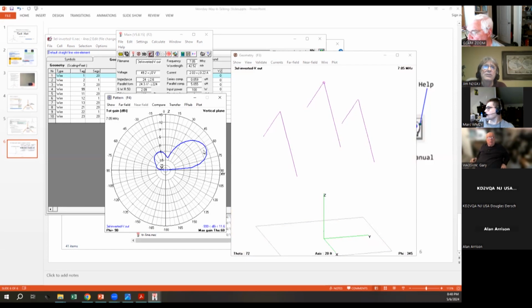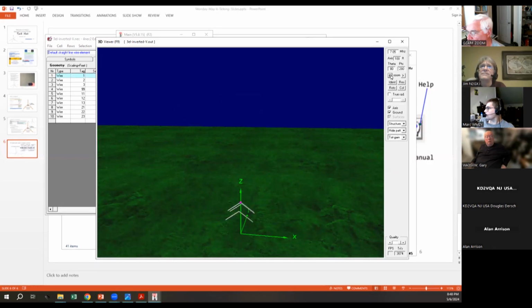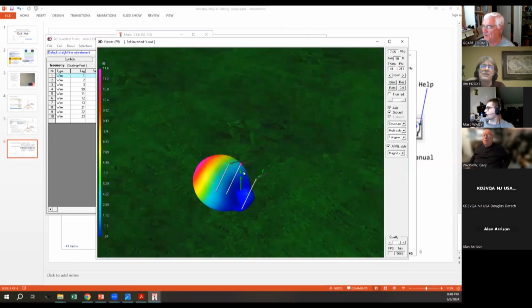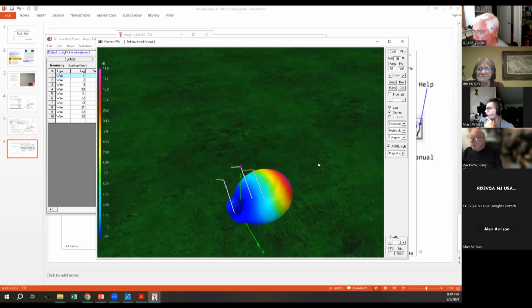They got almost 12 dB of gain just by putting 2 extra pieces of passive wire on their roof along with their inverted V. Not bad. What does that look like in 3D? Like this. And anyway, you can spend hours enjoying the fun. How do they turn the house? There you go. Just got to be lucky your house is built in the right direction.